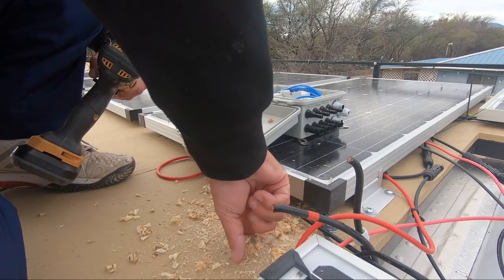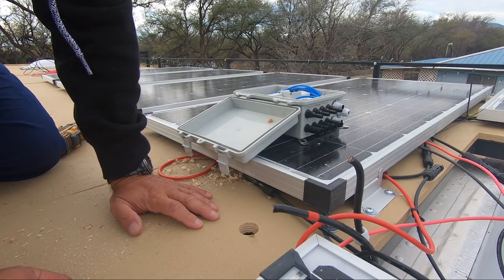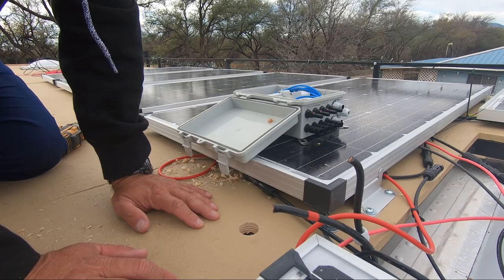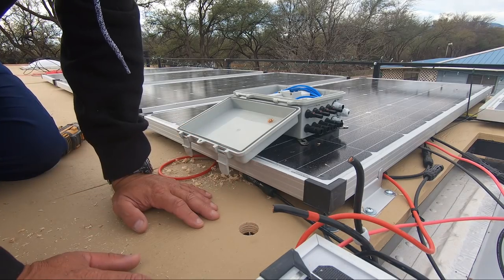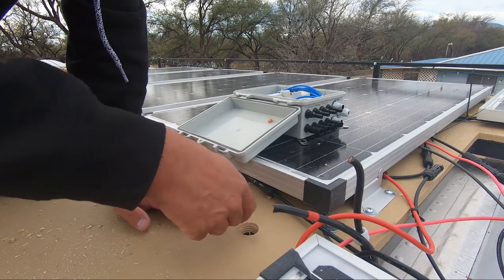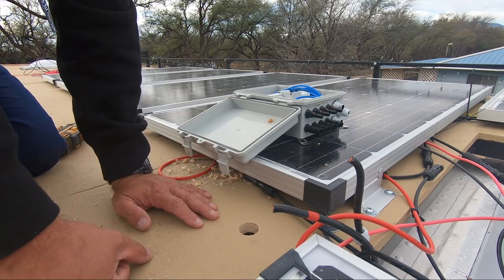There we go — it's like perfect underneath there. In lieu of painting this right now, I'm going to pass the wires through and then caulk this entire hole up so that it's sealed, as well as protecting the inside of this wood. I don't care if water falls through here; what I care about is that the plywood on the inside isn't exposed to direct moisture.